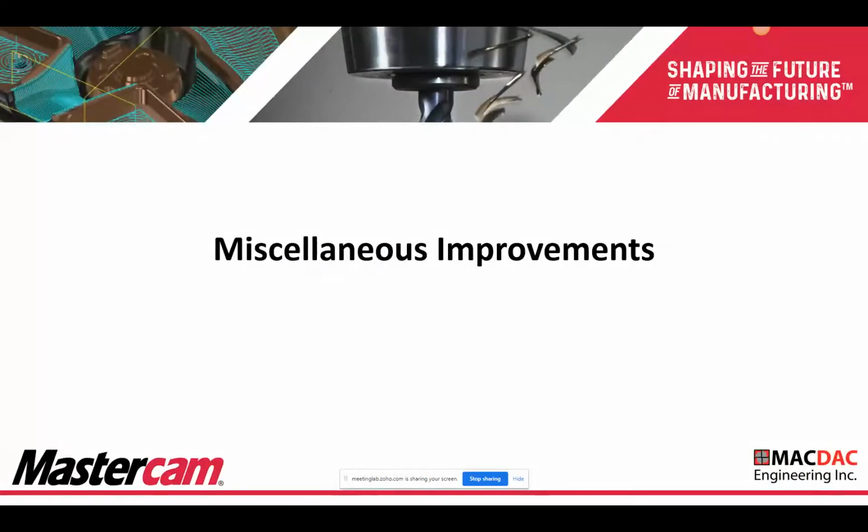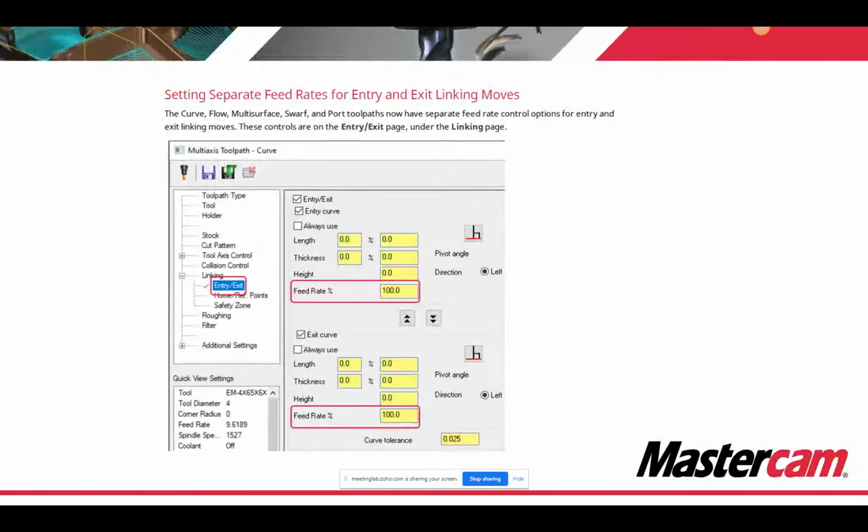All right, so miscellaneous improvements now. For the curve, flow, multi-surface, swarf, and port toolpaths, for your lead in, lead out, you have feed rate control. That's actually really big. Obviously, everyone knows when you first get into a cut, or maybe when you're getting out of a cut, that's usually the time where you may end up adjusting feed rate. So now with some of the legacy multi-axis toolpaths, curve, flow, multi-surface, swarf, you have that ability now.